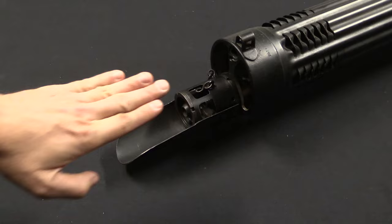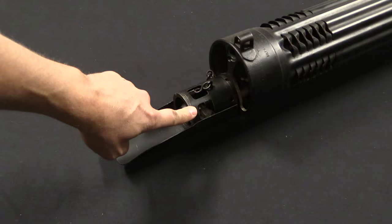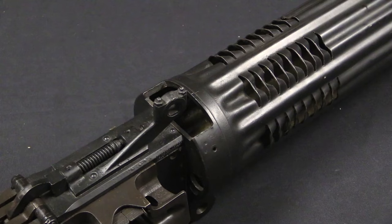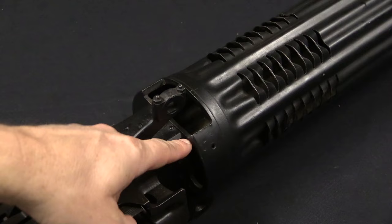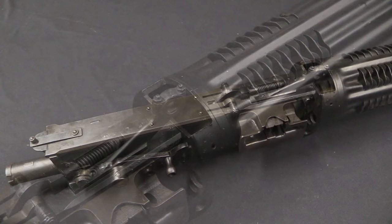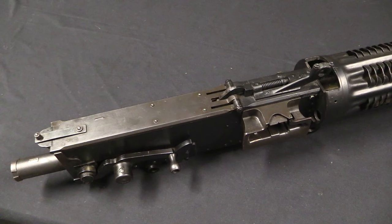This is not really a flash hider — it's just a protector so that the blast from the front of the gun doesn't damage the cowl of the aircraft directly under the muzzle. Moving to the back of the jacket, they've again cut louvers but angled them the opposite direction, pulling air up out of the jacket to help it circulate from front to back. They've also cut out the whole section where the fill plug originally was, and added a couple small holes in the bottom. Basically, as much material as they can take out they have taken out. The Vickers was already lightened from the Maxim design as much as could feasibly be done, so just the barrel jacket was left to address.